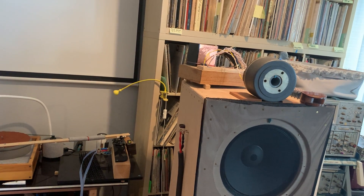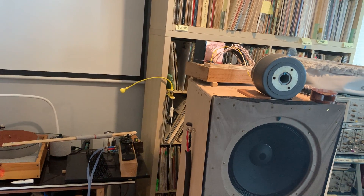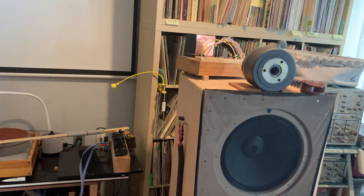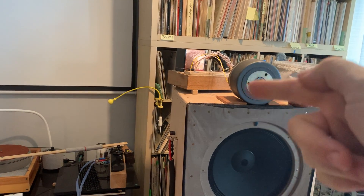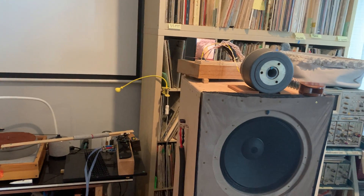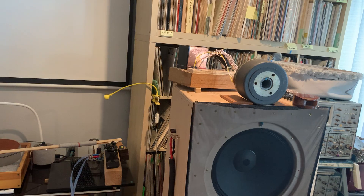Horns are good things and you can play around with them a lot — you can go quite mad finding the perfect one — but you add one more problem to the equation. You also need a crossover network to EQ down the exact range, and that doesn't just depend on the compression driver. It depends on the flare of the horn, your room acoustics, everything. Getting it perfect sends you down a tinkering alley that can take tens of years.